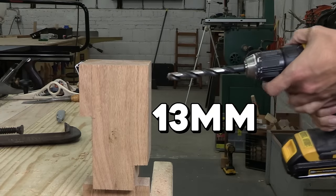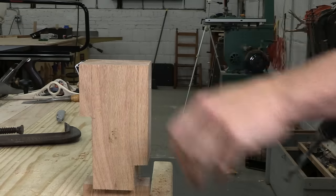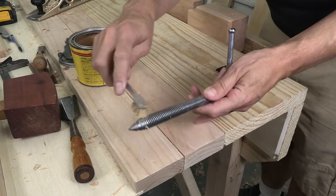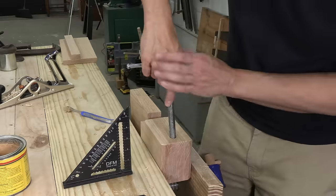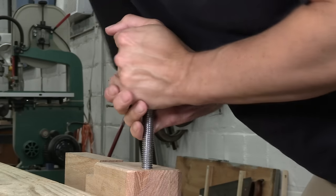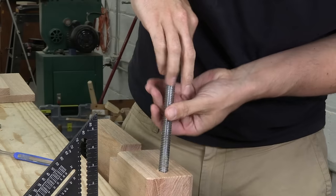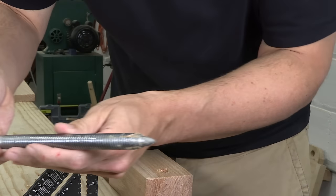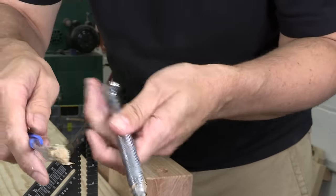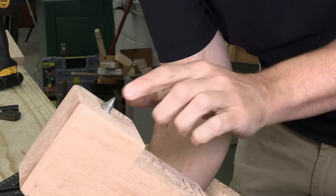My final hole is a full one-half inch, which is also the largest twist bit I own, so I was glad when this hole was big enough. Getting the screw into that hole is hard work, but it's not complicated. I'm using a toothbrush to put paste wax on my screw, and I'm using a square on my benchtop so I have a reference to keep it straight. Getting it started is the hard part, but after a few minutes I can feel the threads bite in, and the screw suddenly feels very solid and stable as I thread it into the hole. Once the screw is started, there's nothing to worry about — just thread it in a little bit at a time, stopping every once in a while to clean the wood out of the flutes and add more wax. After about ten minutes, the point comes sticking out of the other end, and I'm done.